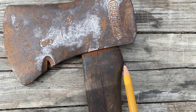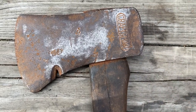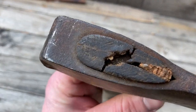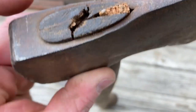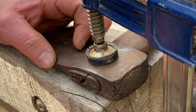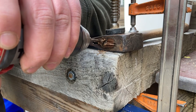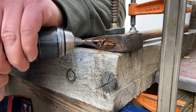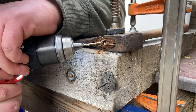What I'm going to do is slide it down to this point — I'm going to have to take off some more material there. But the first thing we have to do is get this metal wedge out of there. This could be quite a process. First, try and get whatever wood wedge you can out, and then try and loosen up around the metal wedge. You can see me drilling it — just don't go too deep because I want to try and reuse the handle.